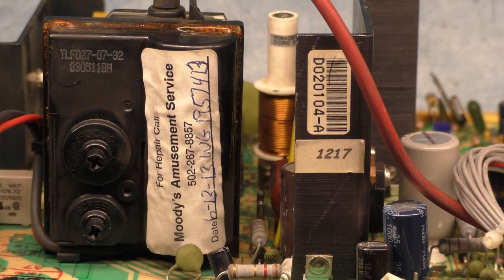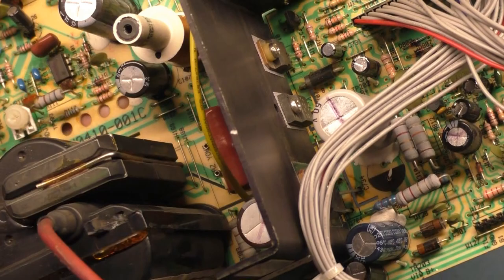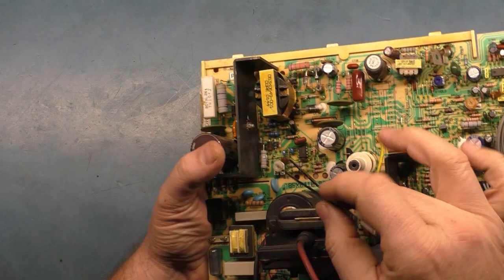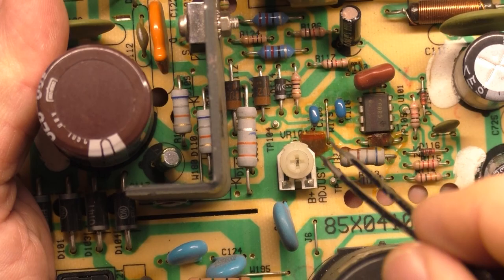So I'll give them the benefit of the doubt, working on this 10 years ago. But if they were the ones that did this work I'm about to show you, then tisk tisk. They didn't change the bipolar cap. Nobody ever changes the bipolar cap except for me, for some reason. And then the B+ is set to dead center. Normally it's not dead center like that, but you can see it's dead center, so I don't think that's proper.